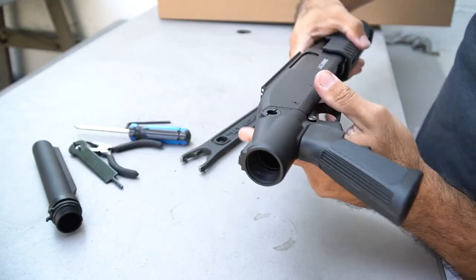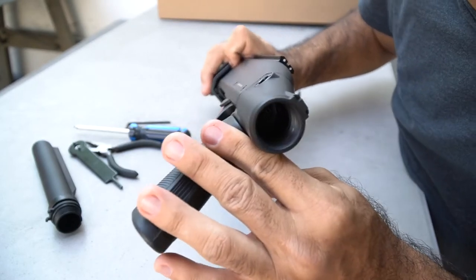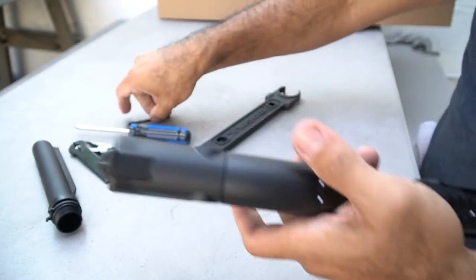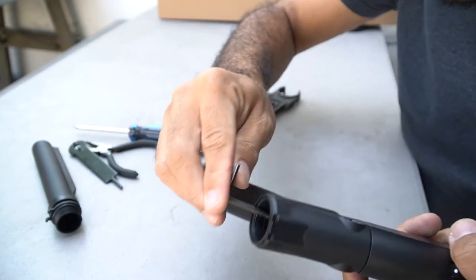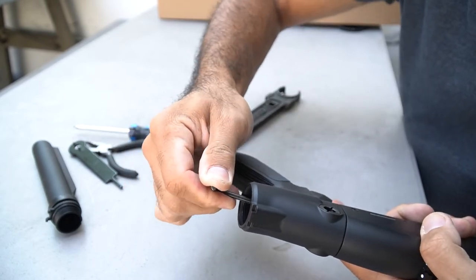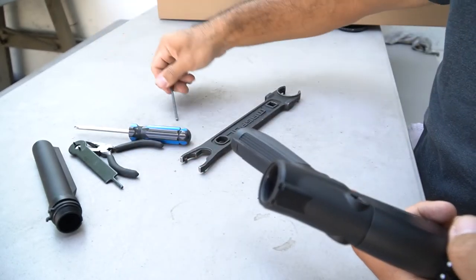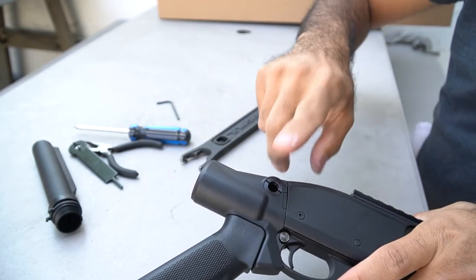With this apart, you'll see inside there's a little bolt — it'll be hard to see, but it's in there. Take your Allen key and tighten it. Hand-tight is enough. This one seems a little loose, so just a quarter turn. Now it's not going to flex anymore, so that takes care of one seal.